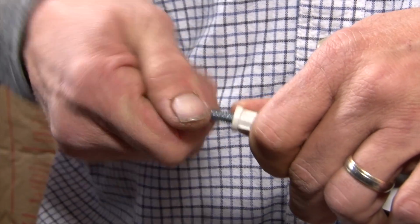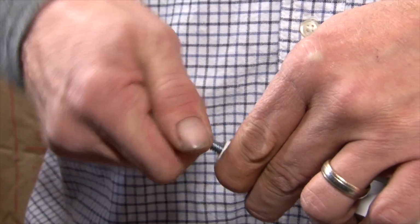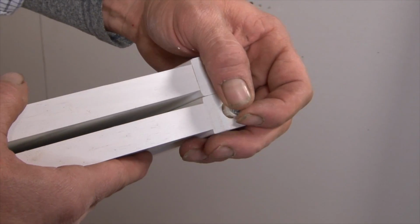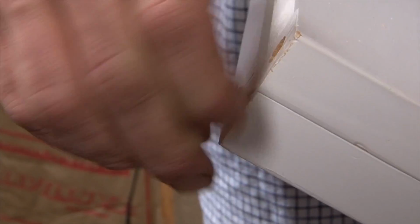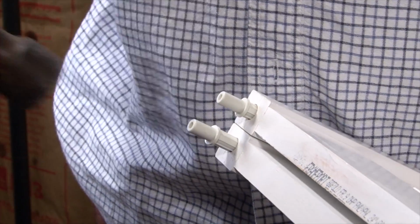Screw the metal knurled hinge pin fully into its plastic sleeve first to prevent damaging the sleeve when tapping with the hammer. Then, insert the entire set into the lower socket of the floor panel, tapping lightly with a hammer to fully seat. Once seated, back out the pin approximately 1/4 inch. Now insert the 2 plastic top pivots and tap in lightly to fully seat.